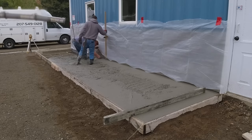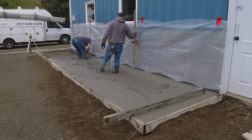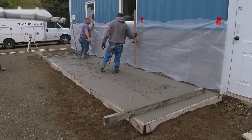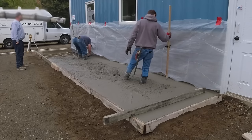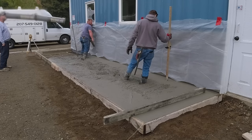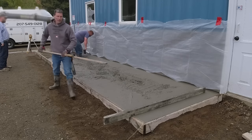Luke's trying to get it up to the top of the ISO foam, and I'm just double-checking to make sure he's right on grade just to be safe. You only get one chance to do concrete right — you don't want to have it off and have to come back, break it out, and do it again. Setting that laser up and checking takes only a minute.